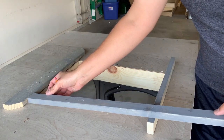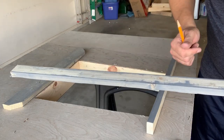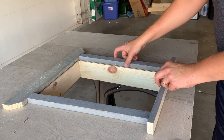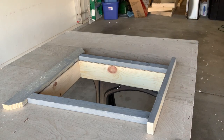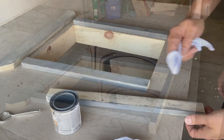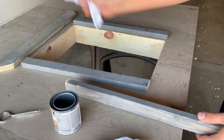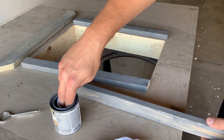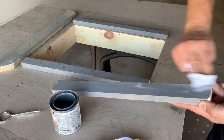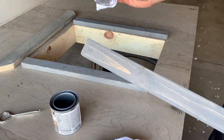For this, you can either use a tape measure or I just hold it in place here and just strike the line so I got the actual angle that it needs to be at and the length all in one. And that's a quick and easy way to get all the trim pieces cut out to go around the window. That's the technique I'm going to use on all the other windows as we go. Just real quick on how I stain this: I've already kind of distressed it a little bit by using a chisel or my chamfer bit on the edges. For small surface areas, I just dip my fingers with a piece of old rag and wipe it on. It goes on pretty gray, but then you go back with the clean part and you can get some of that wood grain to show through, and any imperfection on there will be amplified.